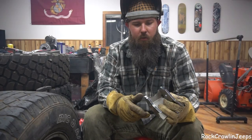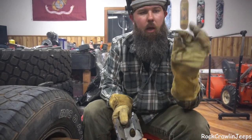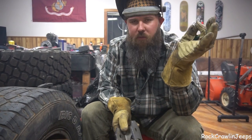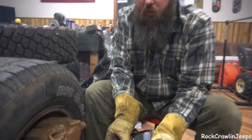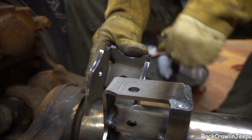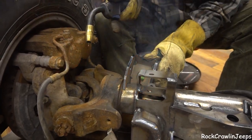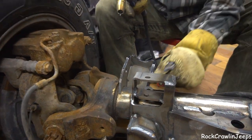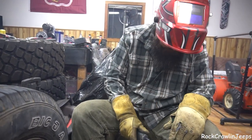We're on to our lower control arm brackets — last brackets of the night. I'm simply using a washer. Artec calls for 1/16th of an inch. We're just going to use a washer and set it right in here between that, and that's going to set our distance. So now I'm just going to tack weld this, pull the washer out, and get it burned home.